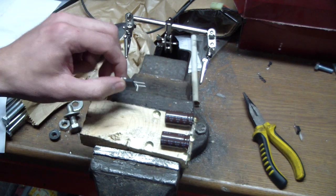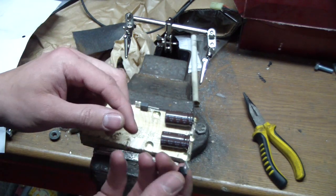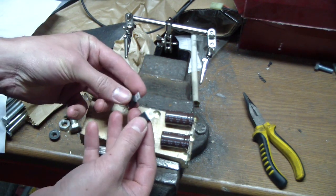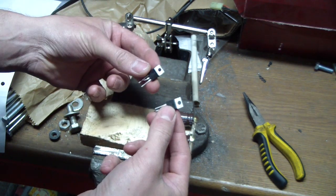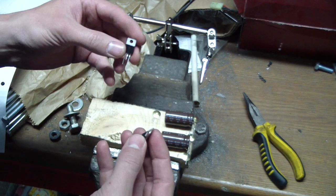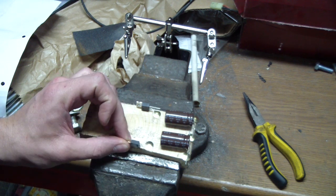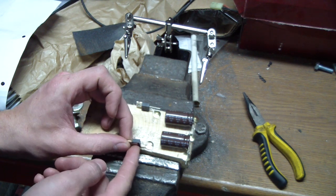And here will go the diodes. These diodes have a heatsink on the back, which I can screw onto a bigger heatsink. My first idea was to put both on one heatsink, but I measured the connections and found out that this little heatsink is connected to the middle pin. So when I put this onto one heatsink, there would be a connection and those two pins would connect — and that's not what I want, because that would be a bad circuit. So I will have to use two separate heatsinks. But I'll first try to work without them, because I don't expect to have great currents — but if there are great currents, I will have to put heatsinks on it.